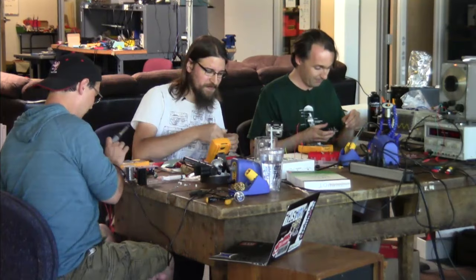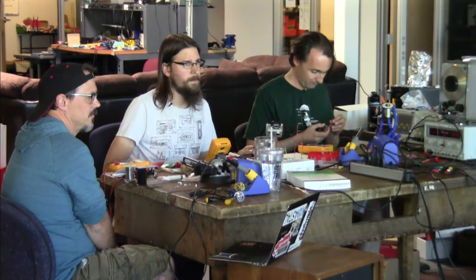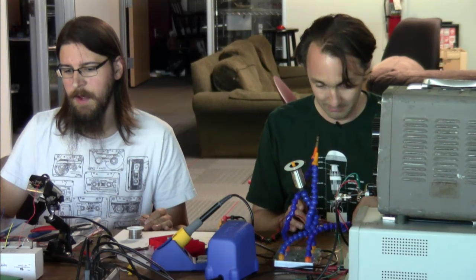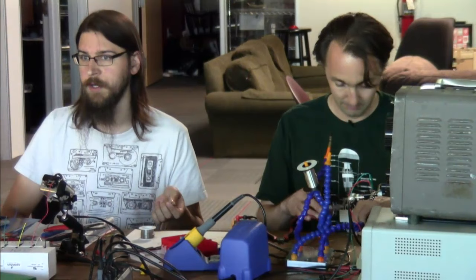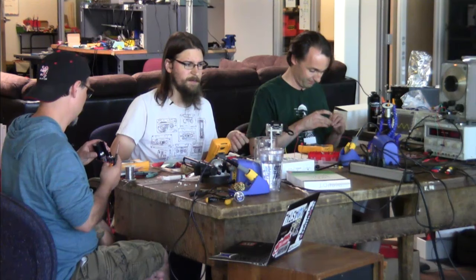Another question. How would you recommend shielding microcontrollers such as AVR, PIC, and others from high voltage noise, like from a spark plug? Caps and inductors. Well, is it coming through the air? Is it coming through the ground? You can put a common mode choke on your power and ground signals to remove perturbations on the power system. So if you're in a car and you've plugged into the 12 volt system and you're hearing noise on that, or if you had a scope connected to your car power system and see a lot of noise on it, that can be filtered out by building line filters or pulling them out of coffee machines or something. If it's coming through the air, you'd probably want to put a can on it and then ground the can.